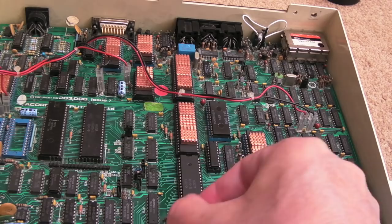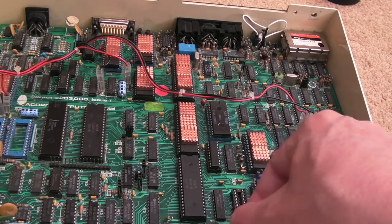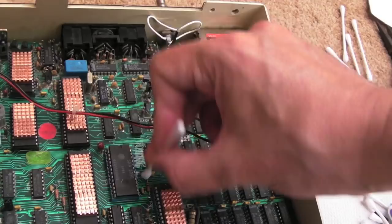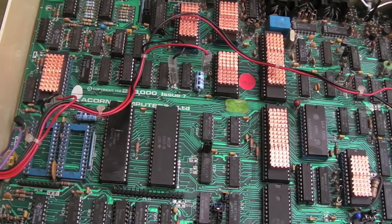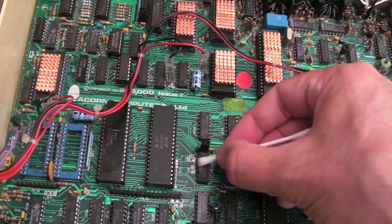While cleaning, I've been marking tested chips with a green permanent marker — a sticker or printing the diagram and crossing out ruled-out components would work too. The green ink just comes off with IPA and paper towel, so I'll clean those marks off when done as there's no point leaving them on at this stage.